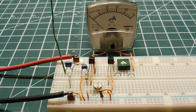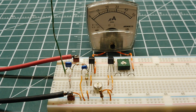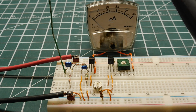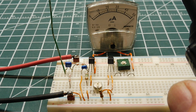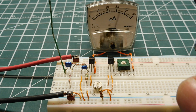For higher power — say a five-watt portable like this one — I'd have to turn down the sensitivity or else I would overload the circuit, and that sensitivity pot is this pot here. I turned down the sensitivity so I could use the five-watt portable to test field strength. I keyed up my portable and you can see I'm getting full deflection on my meter, indicating my five-watt portable is putting out the proper output.